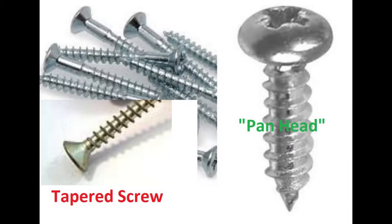You will need to use — I think they're called cheese head screws, not tapered screws. You don't want sunken screws because this is into metal, it's not into timber. You don't want the V-shaped screws; you want the ones with the big knobbly head on.